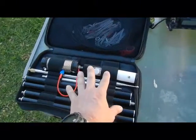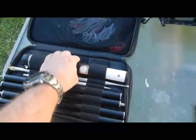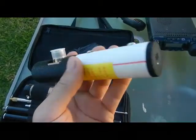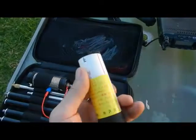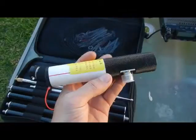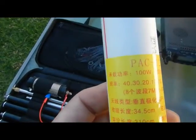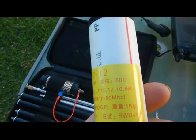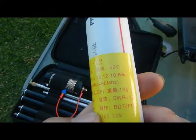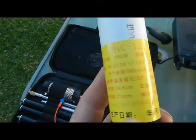As far as the kit, I will weigh it once I get back inside to give an idea of what the entire system weighs. Now this is the feed point here — it all looks pretty well machined and put together. It looks like you can get them in kit form and piece them together yourself, wind the coils, all that sort of business, or you can just buy the commercially made one. So it covers 40, 30, 20, 17, 15, 12, 10, and 6 metres — that's 7 MHz to 50 MHz. There's one kilo here, and SWR less than 1.5.